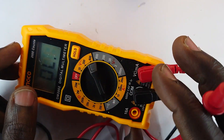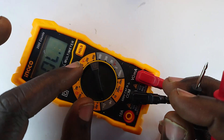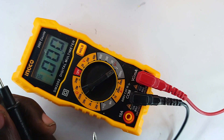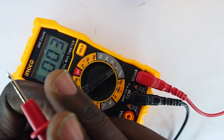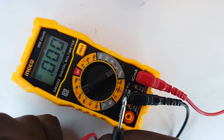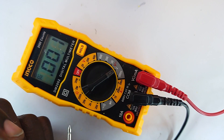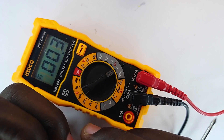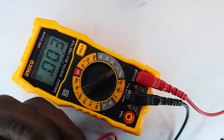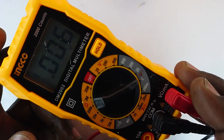If I wanted to know if a battery is functional, I would measure the voltage across its terminals. If it is a rechargeable battery and the voltage is very low, it is most likely depleted or has been discharged for a very long time, making it almost unreliable. However, if it reads around 3.4 to 4 volts for a lithium-ion battery, the battery is most likely capable of storing charge.